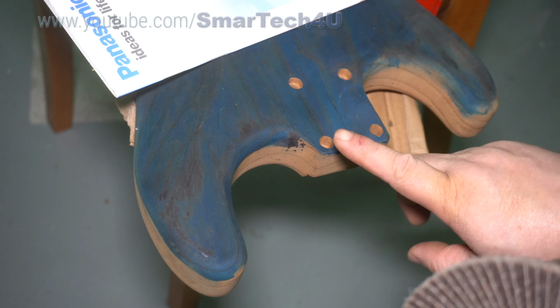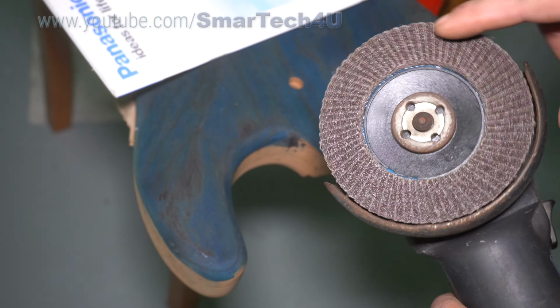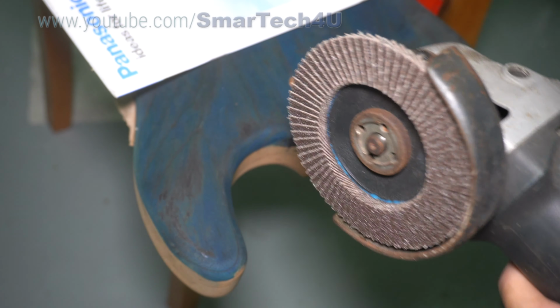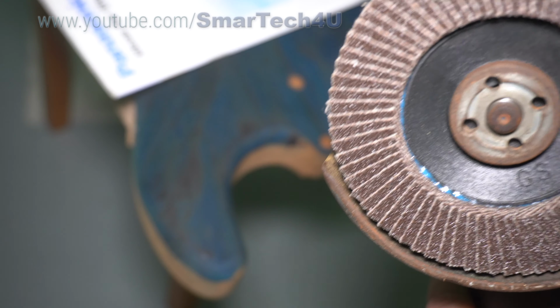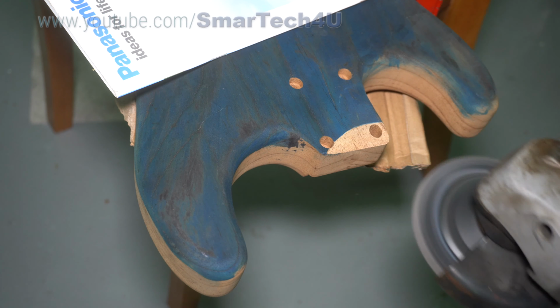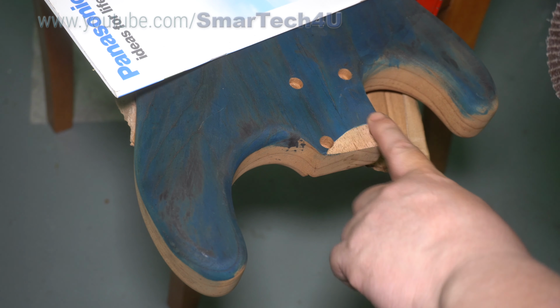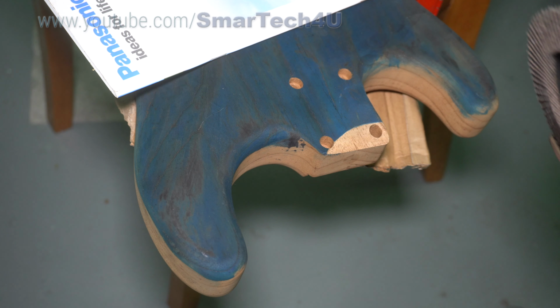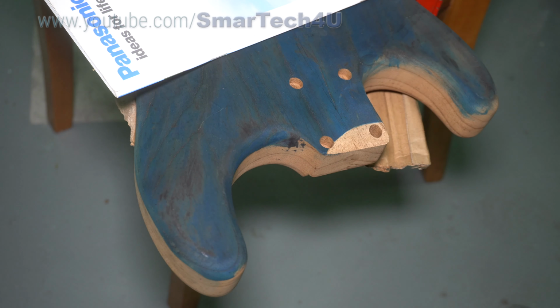For grinding down the corner heel, we start by using the rough sandpaper on the grinding machine. Then we gradually go to the smoother sandpaper. Grind away a lot in one pass, so it's just to make a rough shape first.